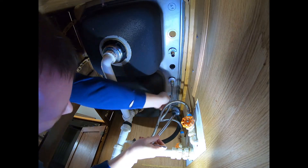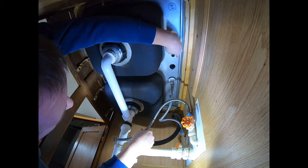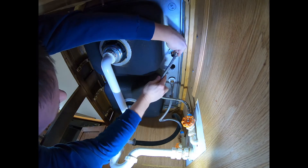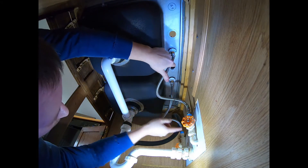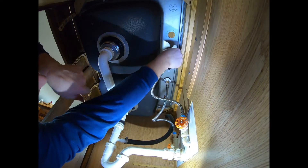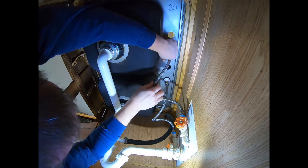You don't have to tighten it like you're putting lug nuts on a car — it's got a rubber gasket so get it good and snug until it doesn't really want to move much anymore. Right there, that should be tight. I'm going to go ahead and do the right side — cold water. You could also label the shutoffs hot and cold with a marker or Sharpie if you wanted to.